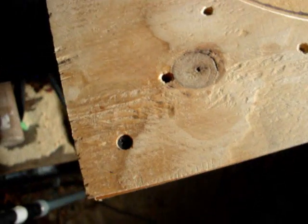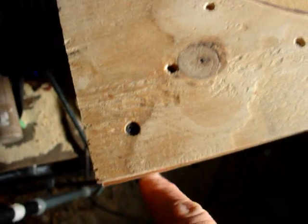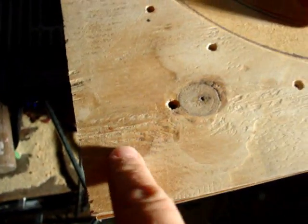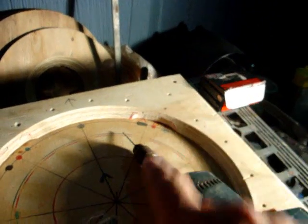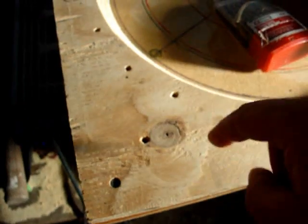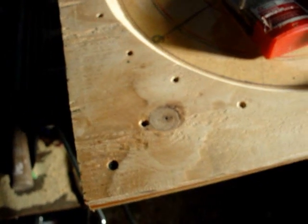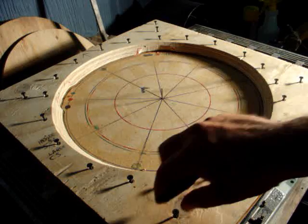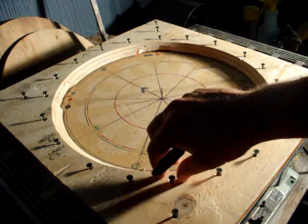The 7/64 inch drill bit, and I drilled down into this bottom board through this hole after this was lined up, and I put this screw in, and I did the same thing over there. Now that this is not going to walk this way or anywhere else and it's all straight, I'm going to drill all the rest of the holes with that 7/64 drill bit. Okay, another beautiful descriptive deal. All of these screws are just setting in their holes.